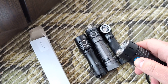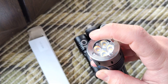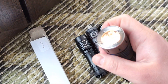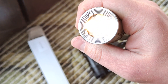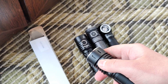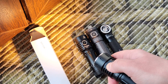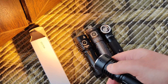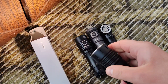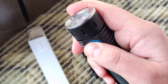Here's how it works: press and hold from off for moonlight — you see all lights start up. Short press steps through the fixed modes: one percent, ten percent, forty percent, and one hundred percent. By double-click from any level you get turbo, which uses all four warm-white LEDs at full power.